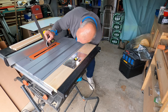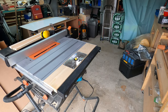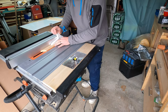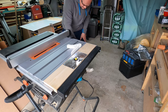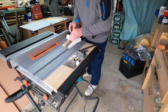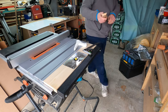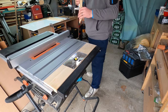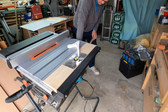The next thing was to set the depth of the table saw to just the right height to cut a channel in the pieces of wood, so the writing whiteboard and the backing board would fit in flush. I did a little test cut with a scrap piece. This is where I made another mistake — I incorrectly fed it through and took the patterned edge out instead of the back edge. But by the time I'd finished and put it together, it actually turned out to be exactly what I was looking for and lay completely flush.